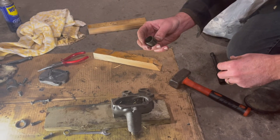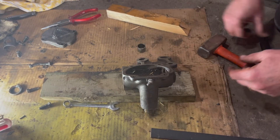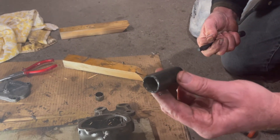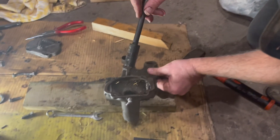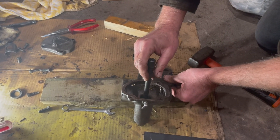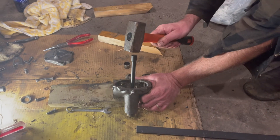What we're going to do here: we took out this cage bearing from the housing. This one came out very easily, and there's another one back on the other side. We have to put together a really clever tool — really what this is is a deep socket with an extender. It fits nicely right down into the hole to give even pressure on that cage bearing. Take your trusty two-pound hammer and just give it a couple taps.